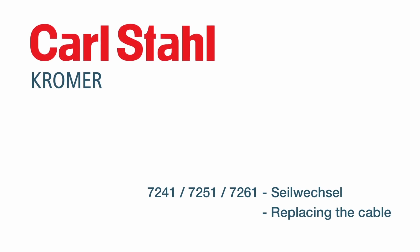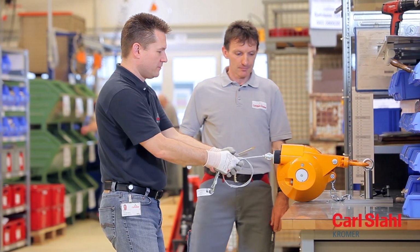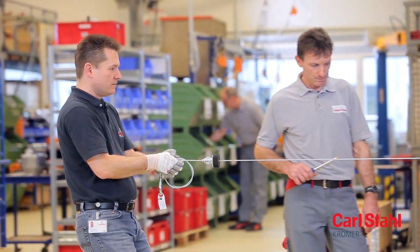Before you start performing the servicing steps shown here, be sure to read the operating instructions supplied with the product, including the safety instructions. This zero-gravity balancer model allows you to replace the cable without unloading the spring and disassembling the balancer. Pull out the cable as far as it will go.